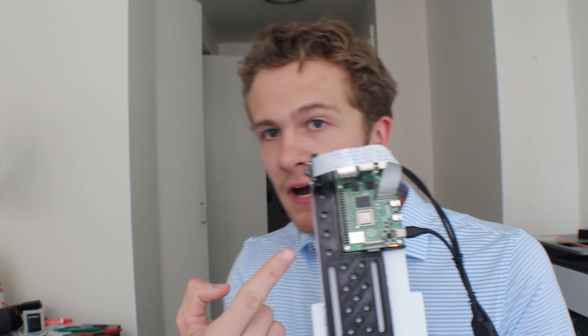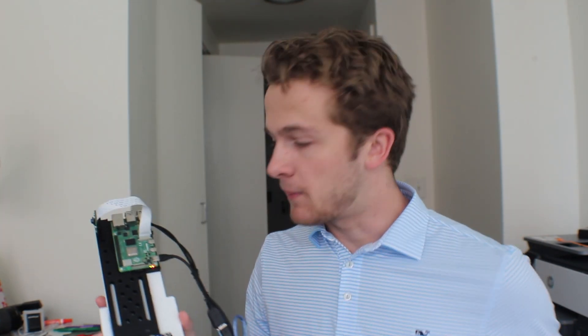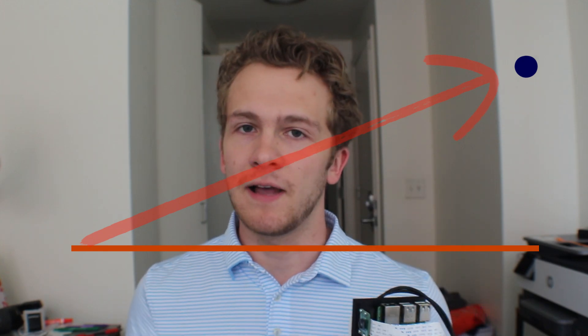By connecting the two, you can see the laser is deployed here and the module turns on, activating the camera. We can access the Pi using its IP address, connecting both our laptop and the Pi to the same network. The laser projects onto an object in the field of view of the camera, and the light reflecting from the laser off that object reflects back into the camera of the LiDAR.